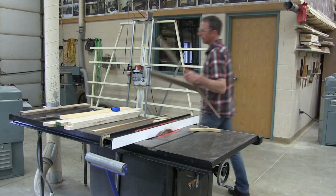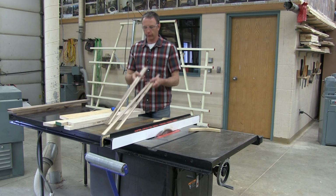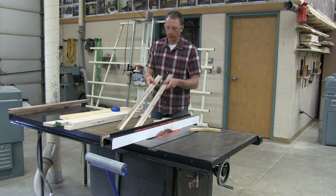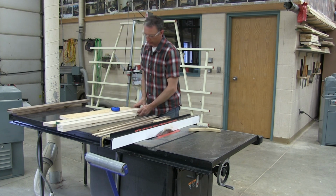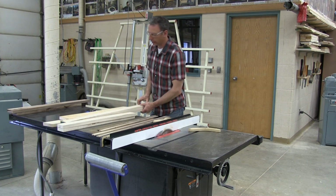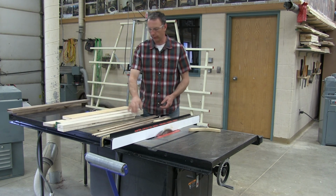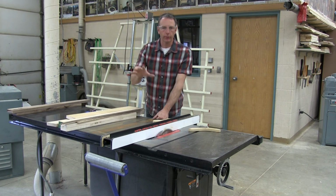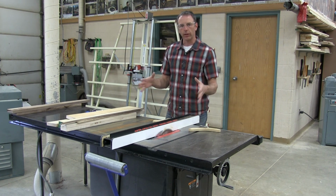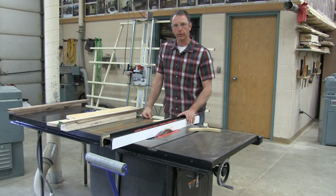Okay, and again, that extra board over here. So you should have 2 short strips, 2 long strips of walnut, A1, A2, C1 and C2, and then your 5.5 inch B and your 5.5 inch D. So that's 2, 4, 6, 8, 10 pieces all together. We're going to take this to a work table, put them edge for edge, make sure everything fits nice and tight. And if it does, the next lesson is going to be how to laminate your boards using pipe clamps. So stay tuned.